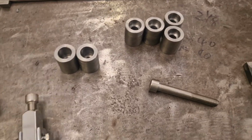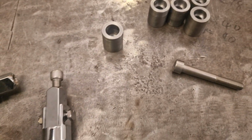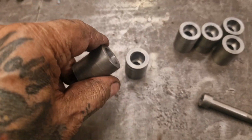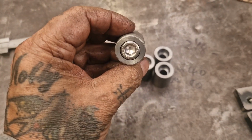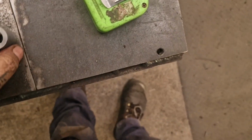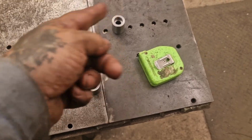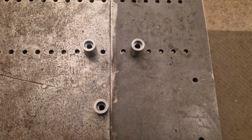Okie dokie. So we've had a rethink. We've counterbored these a little bit deeper than the others because these bolts aren't long enough. I've wound them out, but they'll sit nice, from inside. And they'll sit like that. That's what you'll see. So that's all good. So what we need is a deep one and 2 shallow ones over on the jig. I'm going to have a measure on the bike, but something like that is what I'm thinking. And then we'll join them up, and then bolt the brackets on and take them over to the bike and tack them on. That's my plan.